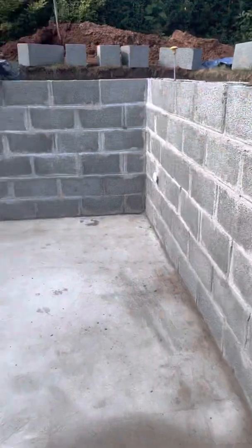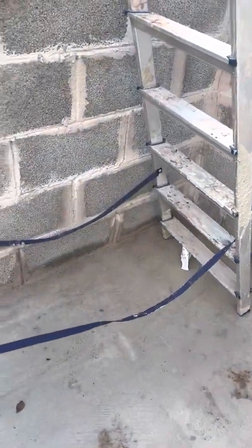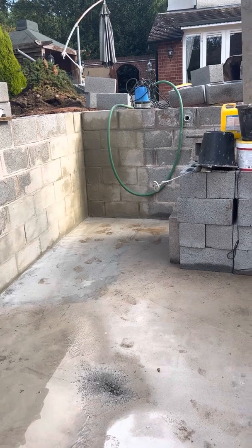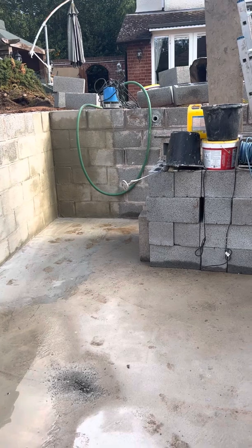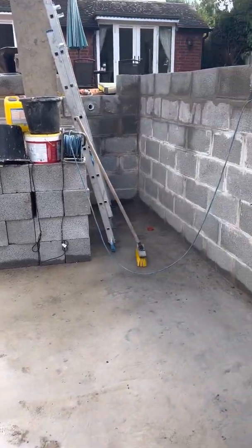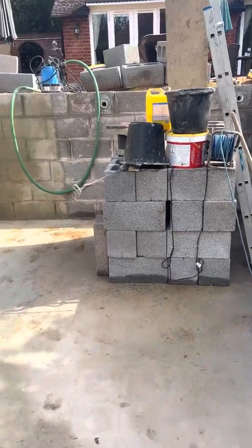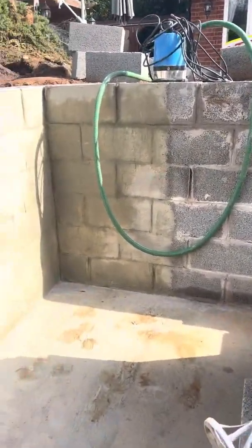You can probably see some examples where it's been raining — the concrete just gets wet and absorbs so much water like a sponge. So the options for swimming pools made by concrete are either to line them with a plastic or vinyl sheet, which forms a waterproof section that completely detaches your concrete from the water, or to use tanking solution — what's known as tanking slurry.